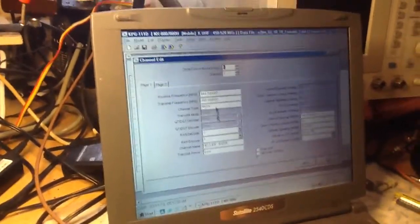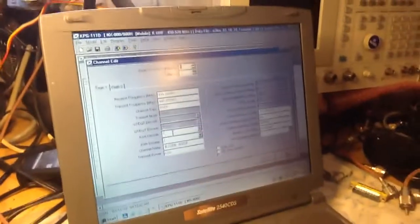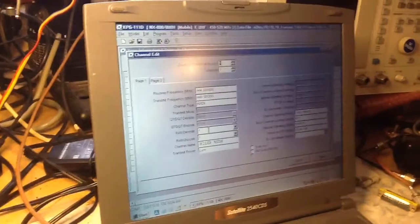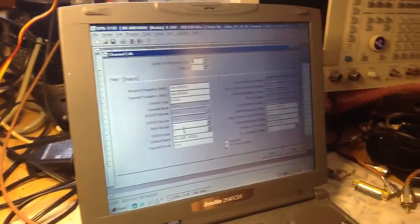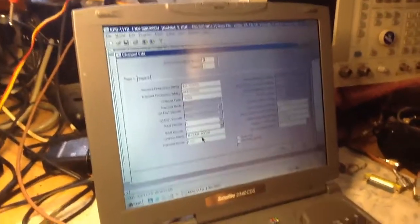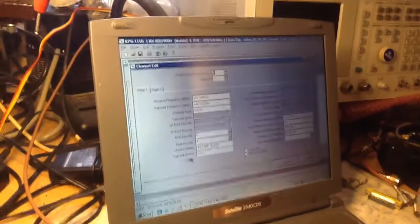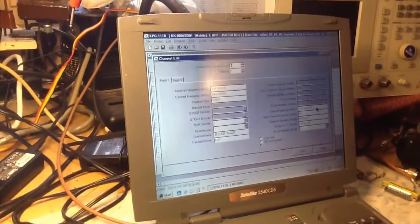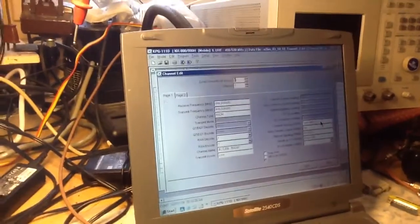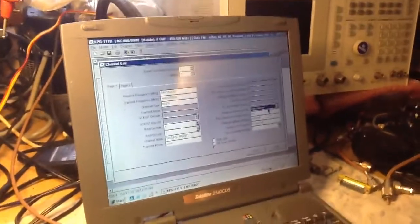Basically, it's the radio access number — RAN — for decode. These are the settings that are working for me on the NX800: RAN decode 1, RAN encode 1. The channel name shown on the display is N2LEN NXDN. Transmit power is set to low. For channel spacing on NXDN, there are two selections — for Kenwood mobiles and portables, you want to make sure you select very narrow.